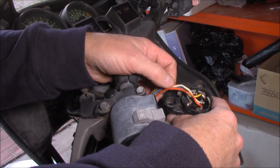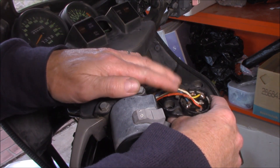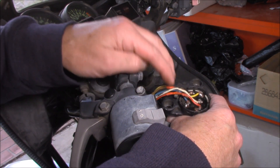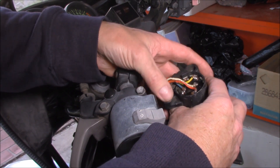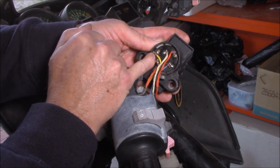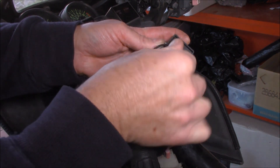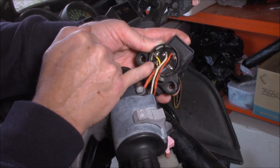You can probably see over here where I've done repairs before where some wires actually broke, and of course that gave me the direction to head because I figured it's just broken another wire. But they look all okay to me. In actual fact, I went to the extent because these little pins going onto the back of the ignition switch were quite loose, so I've soldered them solid so I know that I have good continuity there.